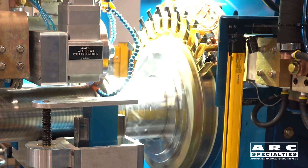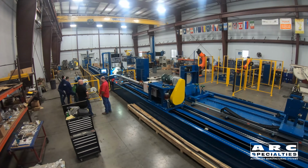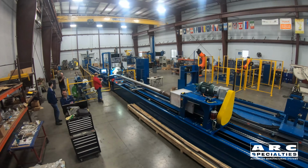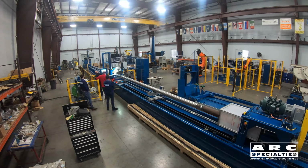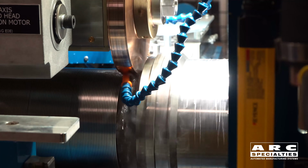And all this, when you combine it together, it resulted in a patent. And I think about half of our customers respect the patent. The other half just know that we're able to weld at over 100 welds per second and hold plus or minus 1/1000th tolerance on the gap, even when the width of the wire floats more than that. This sounds impossible, but we figured out a way to do this.